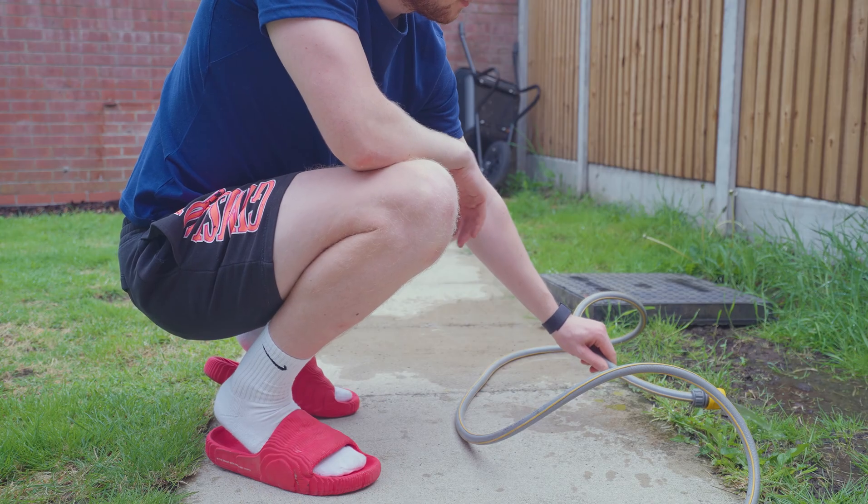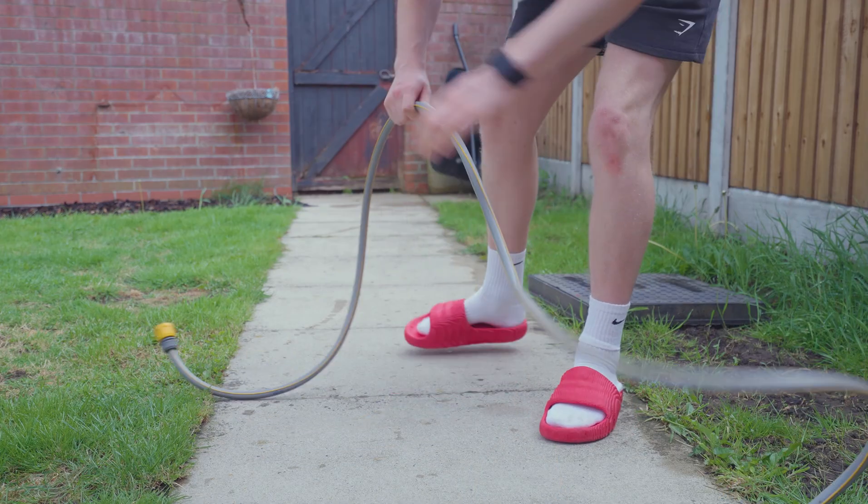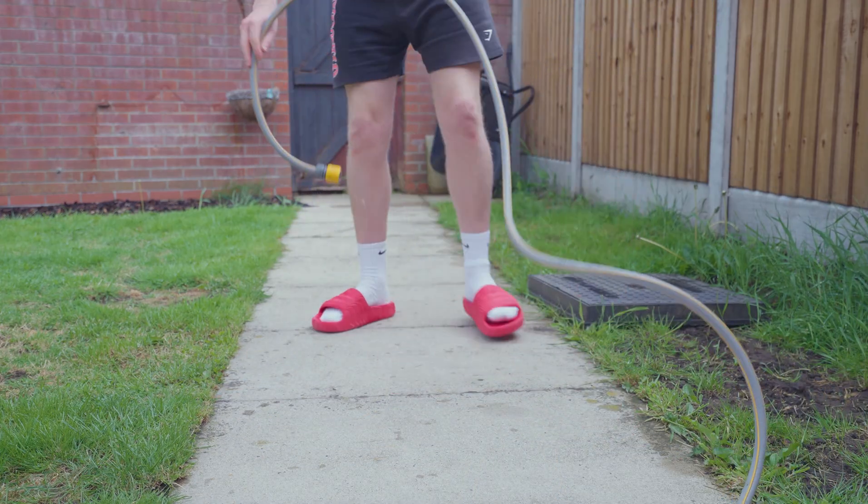Now it's time to open up the valve using your spanner, and be sure to listen out for the other end of the hose to hear the water flowing through. It's great if you can have a second pair of eyes — one at the other end of the hose to see the water coming out, and one on the valve to make sure there's no spillages into the bucket. If you notice a lot of spillages going into the bucket, push the hose further onto the valve. Also make sure there are no kinks in the hose as this can stop the water from flowing out the other end. Once you see or hear water coming out the other end of the hose, you know you're on for a good start.